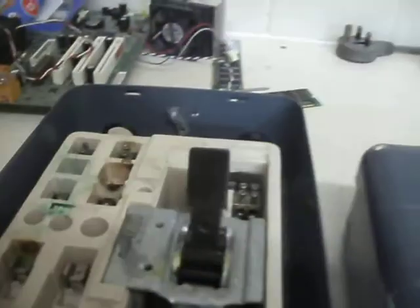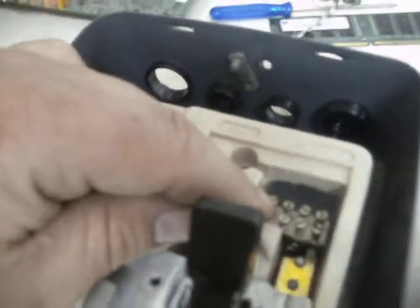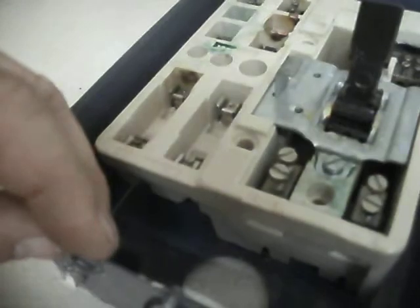It's like a safety precaution, because you have to turn the switch into the off position to get these lids off. I'll demonstrate that in a minute. At the top here, you've got your neutral block to terminate all your neutral wires. And you've got your four fuse holders — I don't have any fuses for this one. There's no earth block inside this, which means there would be a separate earth block mounted on the wall next to these fuse boxes.